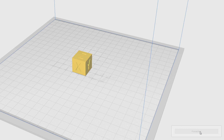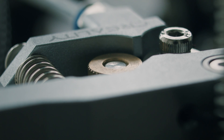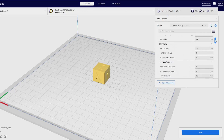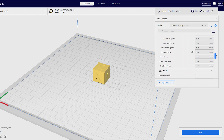For example, I have tweaked my slicer settings quite a lot to get a profile I'm happy with. A slicer is the program you use to convert your 3D model to printing instructions for your printer, also known as G-code. The G-code is more or less just telling the printer what all the different stepper motors should be doing at any given time. In your slicer program, you can set the nozzle temperature, bed temperature, print speed, infill level, fan speed, and much more. And it's all about finding settings that work with your printer and the filament you are printing.